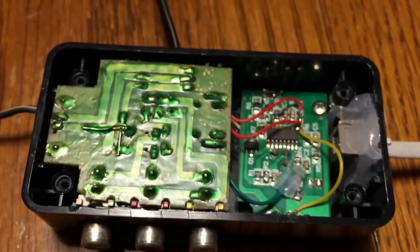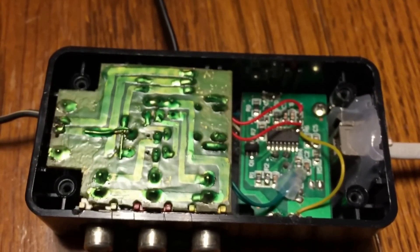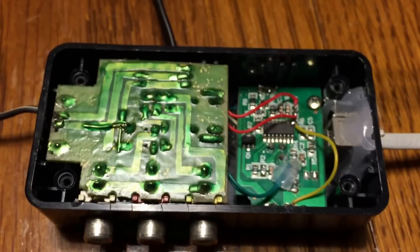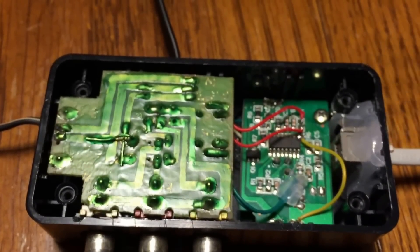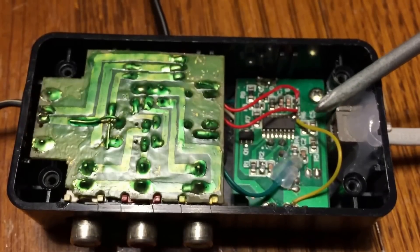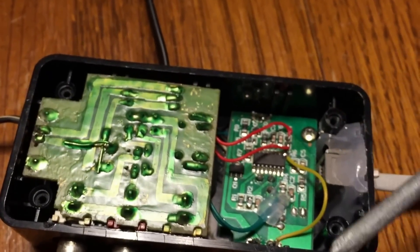I figured out that with this integrated circuit, it has a retriggerable mode and a non-retriggerable mode. Retriggerable means that as long as the PIR is detecting motion, it will basically keep whatever you're powering on until there's no motion and the time calculated by the resistor and capacitor runs out — which is what I wanted. This circuit is designed to be non-retriggerable, meaning it stays on for a set time and goes off regardless of whether there's motion or not. There's another resistor and capacitor that determine the wait time — it waits that amount of time and then it's able to detect motion again. The retriggerable vs. non-retriggerable can be changed by pin 1, which can either go to ground or go to positive. I was just going to grind the copper trace and jumper over to the positive wire — I did that and then it wouldn't go off.